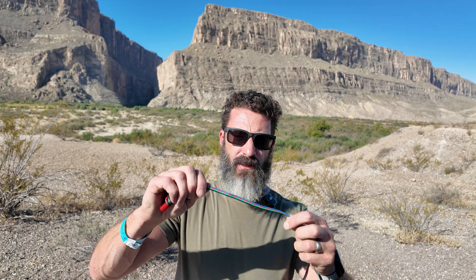The other reason this antenna does not work as well as a regular doublet is we're using this ribbon line as the feed line, and this is not as good as 450-ohm ladder line — in fact, it's probably a lot worse. I'm not sure how many ohms this line is, but from what I read they're guessing maybe 100 ohms. In the article in QST from 1979 about zip line antennas, they did a bunch of tests and found that the lamp cord was about 100 ohms, and it was quite lossy, especially when the SWR climbed. This version has the two middle wires still in it, so that probably has an effect too.